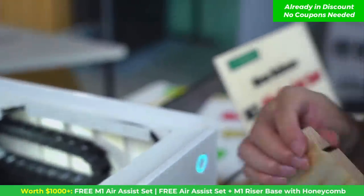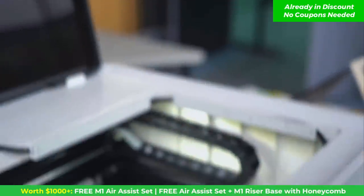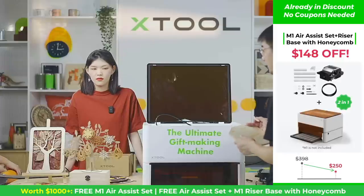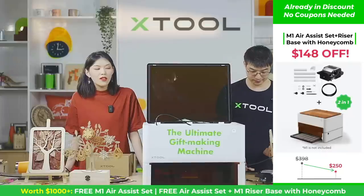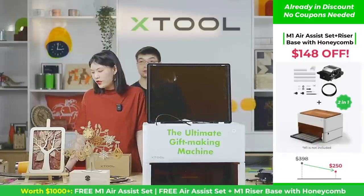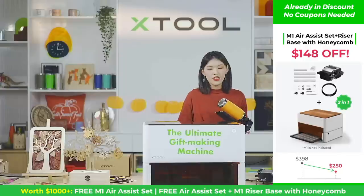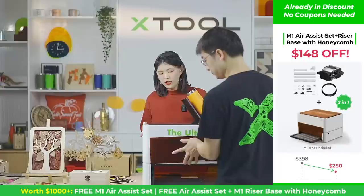wood with 10 millimeter. But for 8 millimeter and 9 millimeter, I think it will cut through it. And that depends on your wood. If your wood is very dry wood, I think it's very easy. But if it's a wet wood, it's hard to engrave, hard to cut through. We cut it really only once, so we didn't test so many times. We just want to show you the most realistic situation. But I guess if you change the focus, use a drier wood, try it a few times, I think maybe you can cut a thicker pine wood successfully.